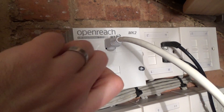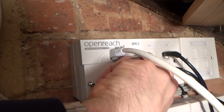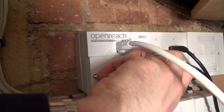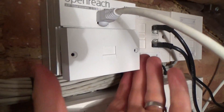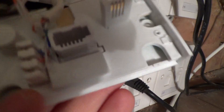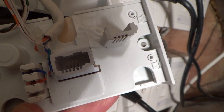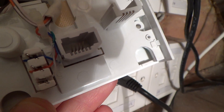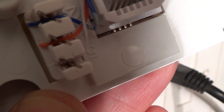Basically if you take off the front plate — I've already loosened the wires previously — and if you slide it out and have a look at the wiring, you can see there you've got five at the top, three in the middle, and two down the bottom. Everything looks normal until you look at the top terminal there on number five.